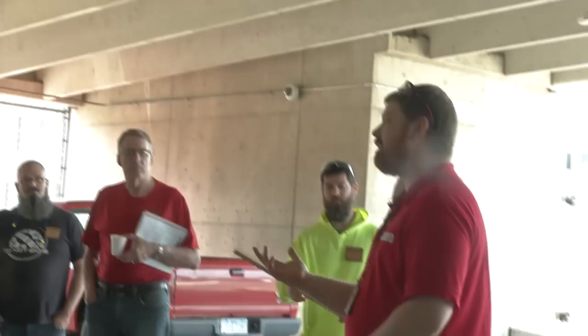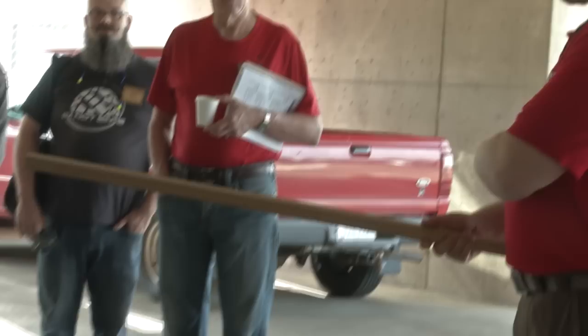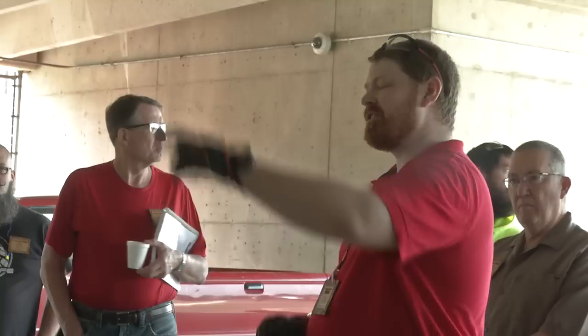For my stickers I'm mostly cutting white oak. You typically want a hardwood for stickers. I've had okay luck with red oak but you get a little more staining than with white oak. I have a whole pile of white oak stickers — it sounds expensive but wood grows on trees. Another thing I'll do is make laminated stickers. If I have old stickers that have gone bad, I can laminate them together or take thinner pieces and stack them. I've had really good luck with that — I glue it up with Titebond 3, which is an outdoor wood glue, and once together it's kind of like plywood. It no longer wants to bow, crack, or soak up moisture. I have a few stickers today made out of maple because I was trying to come up with a few more.